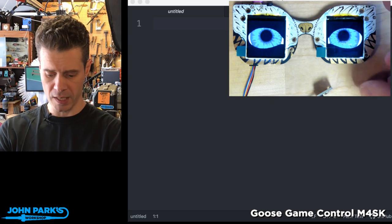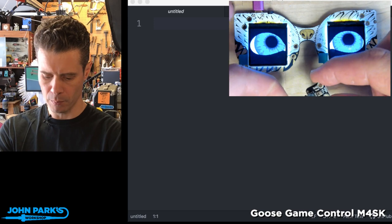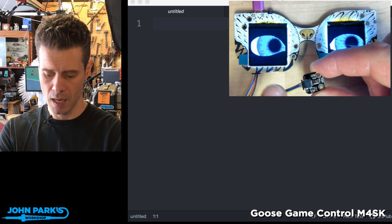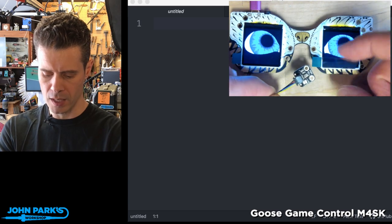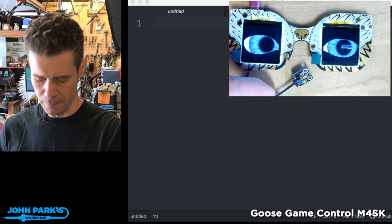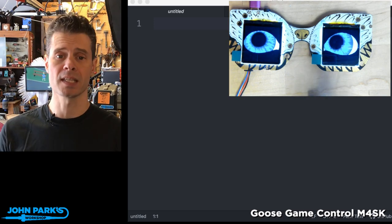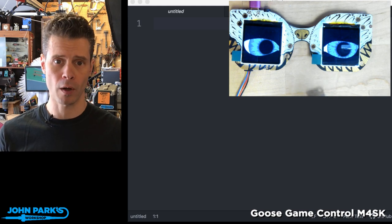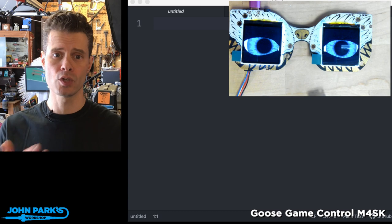So all I was explaining is that I've got my Monster Mask plugged in, and I've got a PDM microphone plugged into it using the Stemma QT connector. This microphone is going to detect any sound over a certain threshold. And I'll show you the code for how that works in a second and how you set this up. But the nice thing is this is an M0 or an M4, any M0 or M4 based board. This one's an M4. Makes it very easy to do USB HID